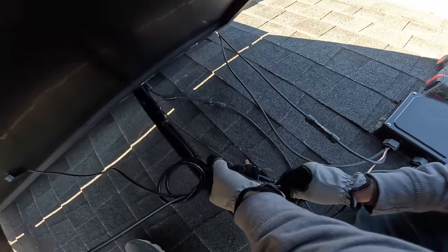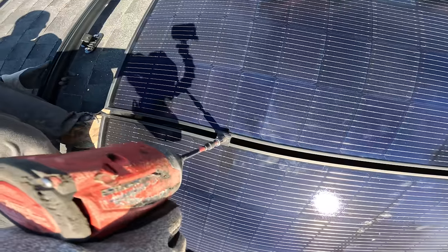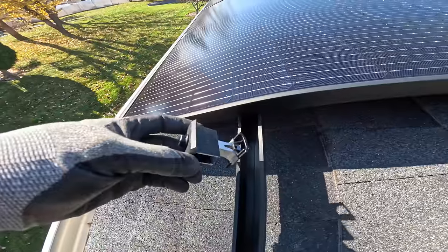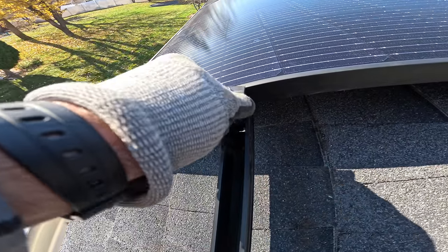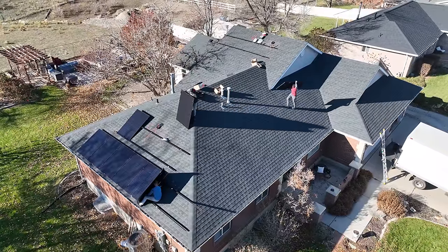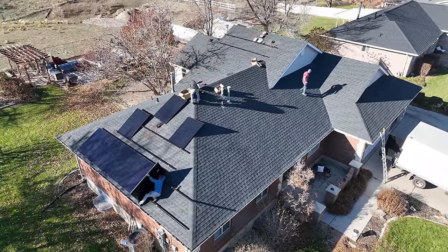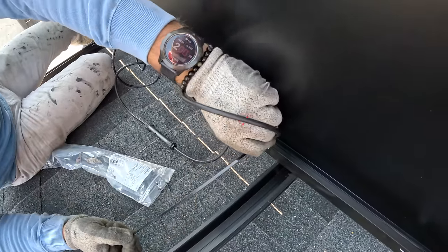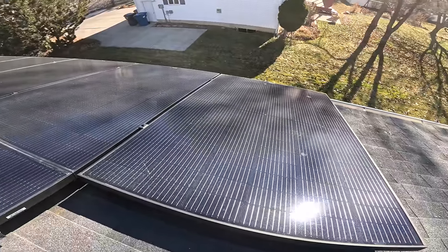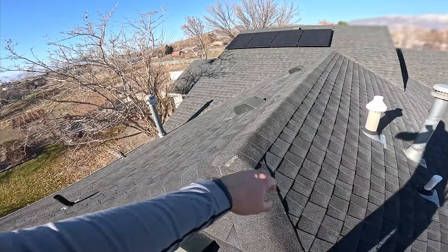While there are many different use cases for this system, my favorite part is that each inverter has two solar inputs — a high voltage array and a low voltage array — that brings in 5,600 watts worth of solar juice to each stack of batteries. All of the panels installed on my parents' roof charge up the batteries, which in turn power the house. None of the juice flows out to the grid. The larger lower array is the high voltage array and the top group of panels is for the low voltage input.